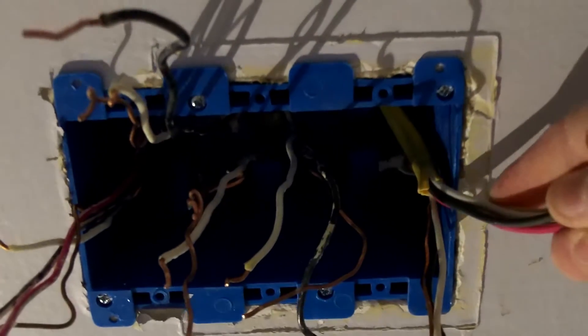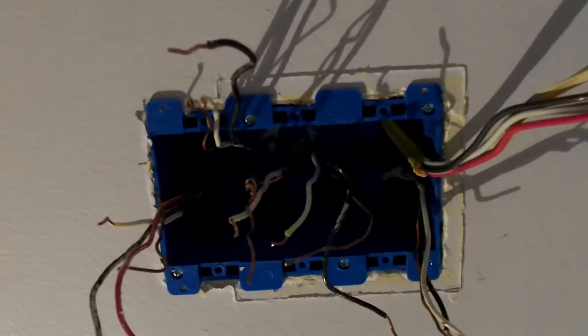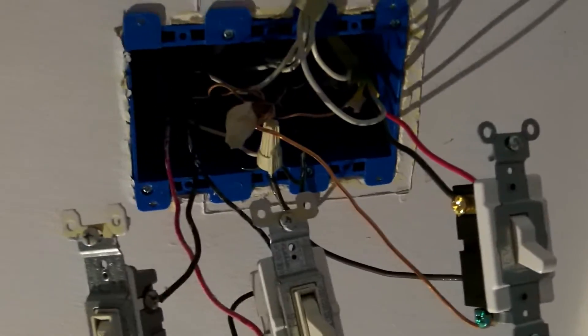I've got my wiring in place and my new box — it was a pain, this one fought as well. You can see up here I've got my new yellow 12-3 Romex, and the other things are all in place basically where they were before. Now I'll wire them back up together, including the wiring for the fan and the new switch into the circuit. I'm back from all my wiring extravaganza — you can see the rat's nest of wires, but they should all be hooked up correctly. I've got my new switch here, wired up to most of the yellow wires, and hooking into the hot black wire. Now I need to go to the other end of that yellow Romex and hook that up to my fan up in the attic.